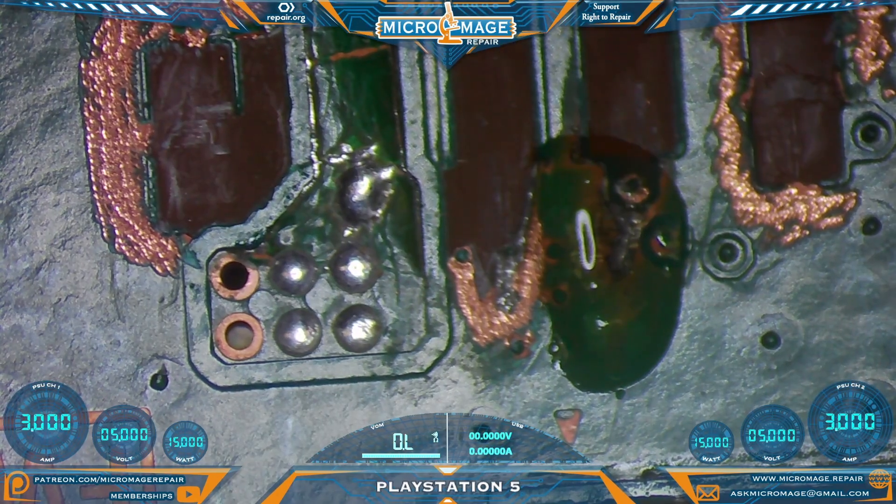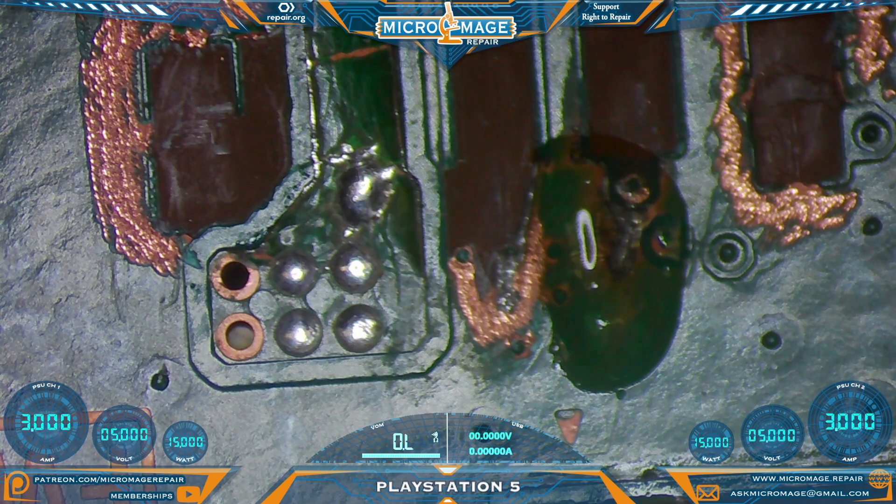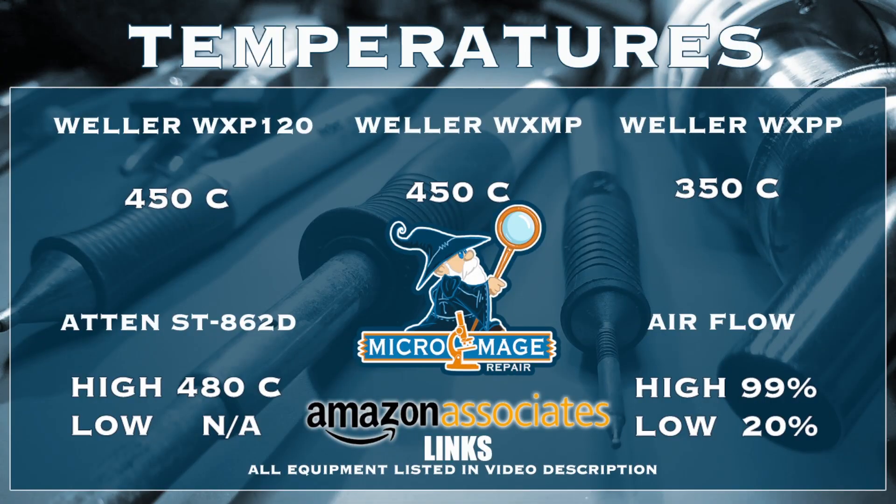What I want to do here is clean up this area a little bit. It looks like some people got some solder there, and I'm probably going to want to isolate that area from the via and the wire that I'm going to have to run there, so we may go ahead and cure that up. In order to do that, I'm going to need my equipment.